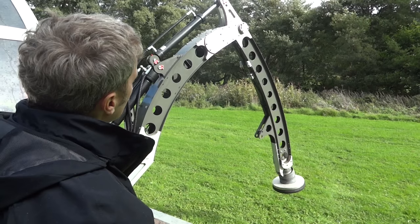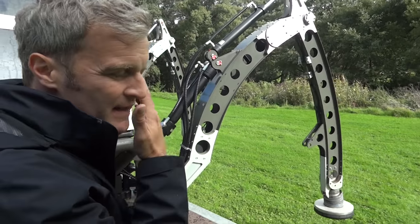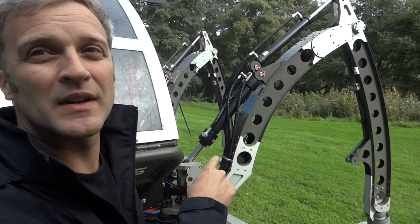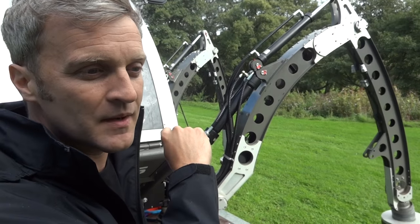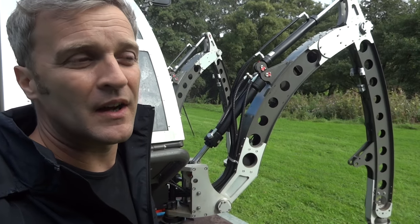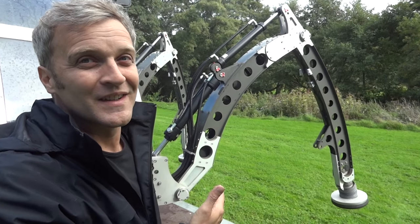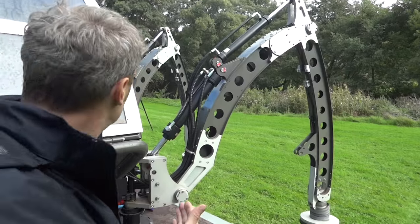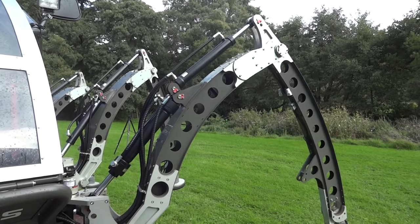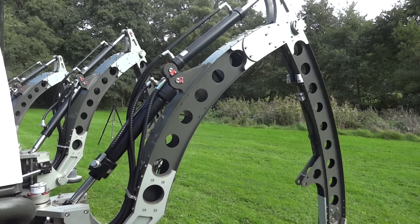It's quite agile actually for its size. What's the maximum speed it will do? Theoretically the rams aren't supposed to go above 500 millimeters a second, but that speed is terrifying. When I'm simulating at home the simulator tells me the speed of all the rams as I'm walking and they never really get above 250 millimeters a second — that's when a leg takes a big sweep forwards — but of course it's only limited by software. Right now I think this is running at 211. That's just a generic speed because that doesn't look like 200 millimeters a second to me.